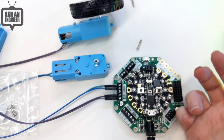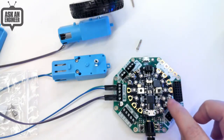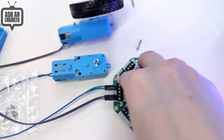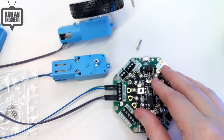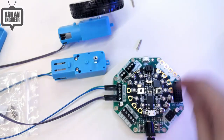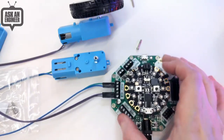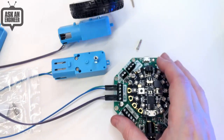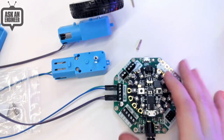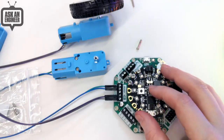There's only like 8 pins available. So instead we have the coprocessor do all of that work and then we send commands over I2C. So the Circuit Playground can focus on doing the Circuit Playgroundy stuff, and driving motors, setting the PWMs, or reading capacitive touch is handled by the little helper. When we did the design, it just turned out to be easier and cheaper to have a full other SAMD processor do that for us. Even though it's not a lot of firmware, it has all of the pins and all the timers that you need.